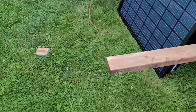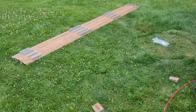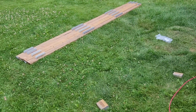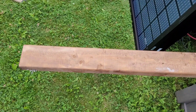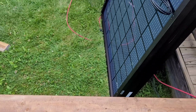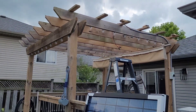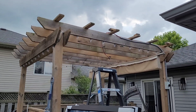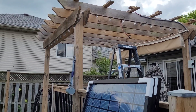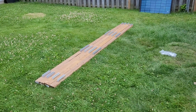The rails are all secured. I'm cutting four one-foot chunks of 2x4 with a bit of an angle on the end — a five degree angle — just so things line up square. These are going to screw right down to the ends of the 2x4 straps that go across the top. Everything lines up really well — those are 12 foot 2x4s as well, so it worked out perfectly. Super simple system; if you have a pergola, it's a really good way to add solar.